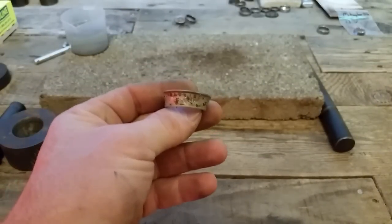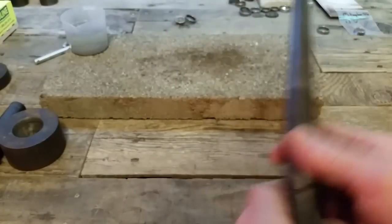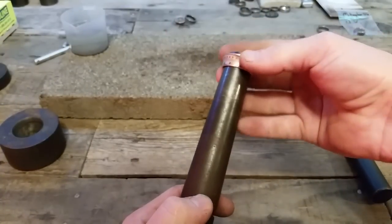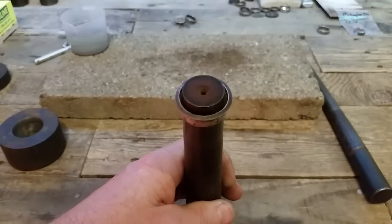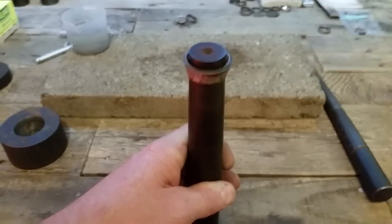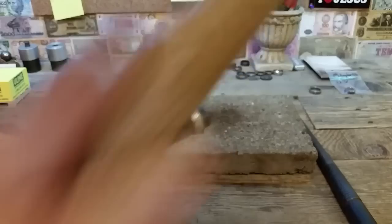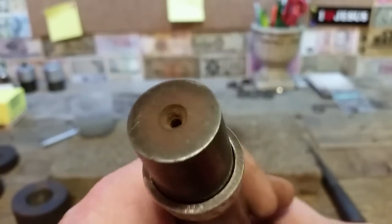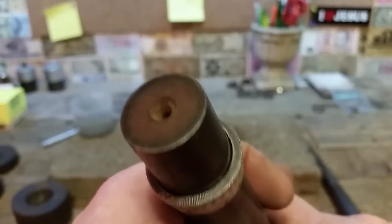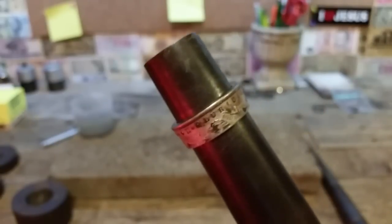When we decide to hammer down a mandrel, we encounter another problem with Morgan dollars — a regular size mandrel won't fit. They also make larger mandrels, and this one barely fits on top, which is perfect. We're going to take this and hammer it down until those sides are flush against it. It's already annealed and soft, so we just start hammering. Keep turning it as you hammer — hammer it evenly like a regular half dollar or quarter. That didn't take a whole lot of time — it's hammered nice and snug up against there. Just like the half dollars, we don't want any bumps or protrusions sticking out or it will mess you up in the sizing stage. That is ready to be annealed again and then we'll move on to sizing.